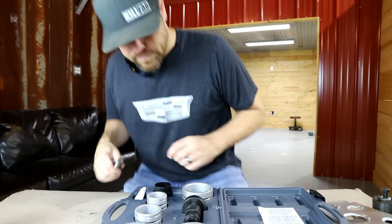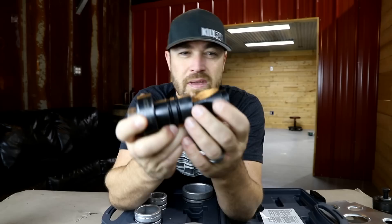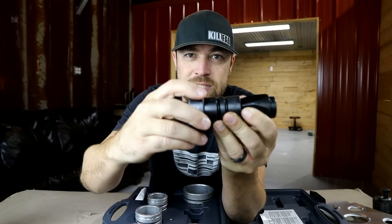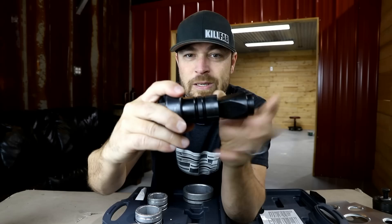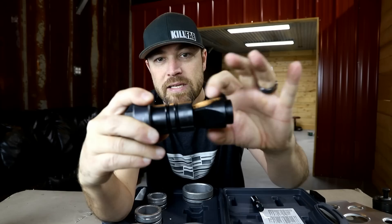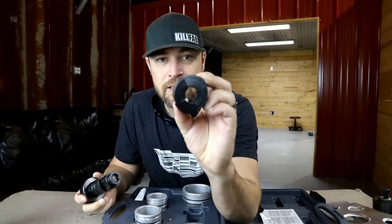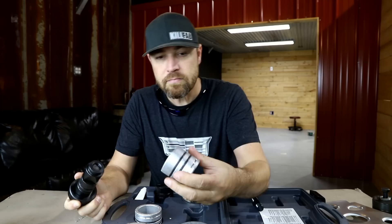So it starts off with this section here. This thing basically has a big heavy-duty fine-thread bolt, and there's actually a bearing in here. This bearing allows the bolt to turn freely, because as you start putting this thing in a bind, these pieces right here aren't going to want to turn. It's got a collar, it's got an expander, and then it's got this tapered end. So as you tighten this thing together, it pushes this expander over this piece here, which causes it to expand. And then you've got different pieces depending on the size of tubing — that's a second expander, they give you two, depending on which one you're using.